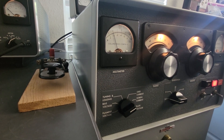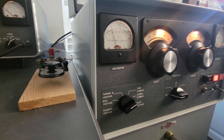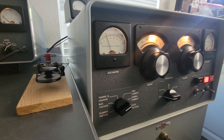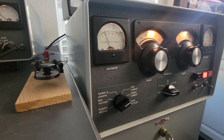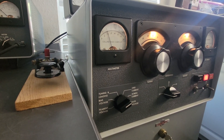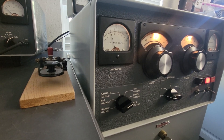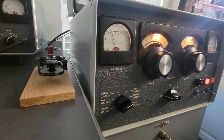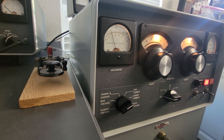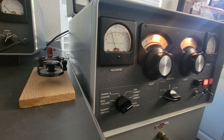What I recommend is to keep the multimeter on screen current. Once you understand how to tune the amplifier, you're basically just going to use the tune control for maximum output on your watt meter. That'll peak the screen current, and it'll coincide exactly with the output power — so once that's done you're in resonance. The loading control is now going to allow you to get the screen current to zero. Move the loading control up and back until you get right around zero — you'll notice that's just about maximum output power as well. Then you can go back and touch up the tuning control to make sure it's peaked. And that's it — it's as simple as that.